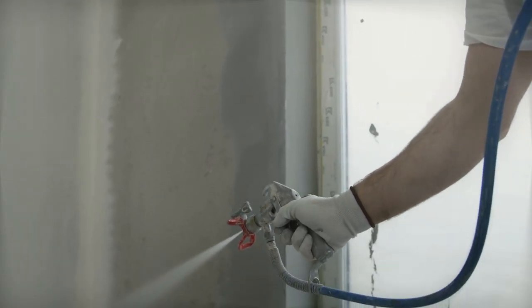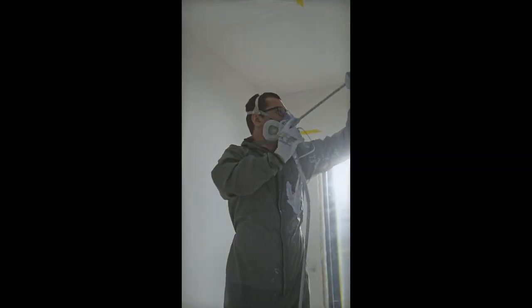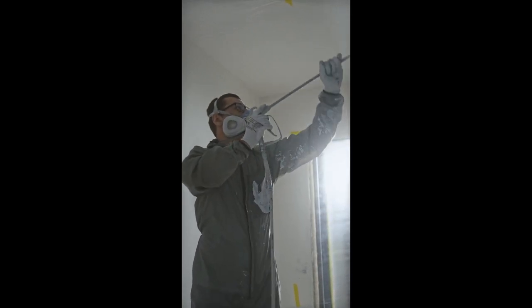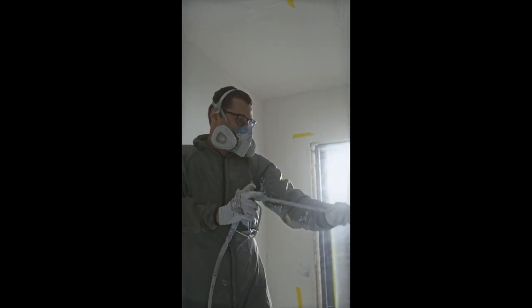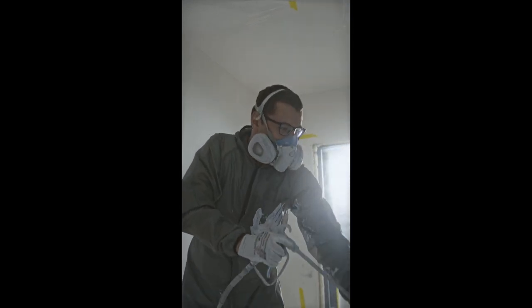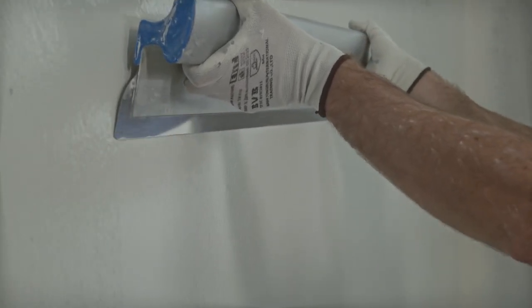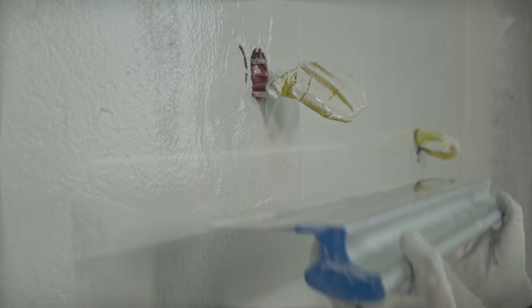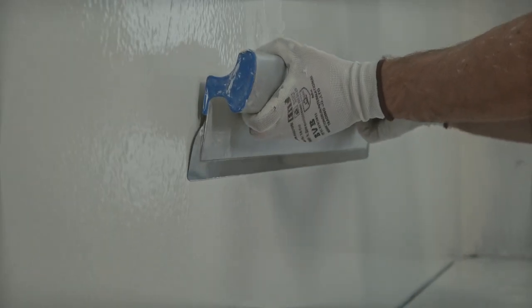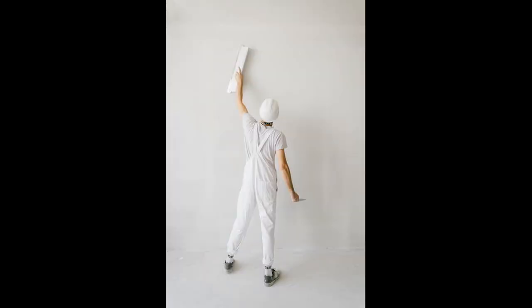Before you start, we recommend having many Darbys at different lengths at hand. Using a 3-foot Darby works very well with this material. Make sure there isn't a low buildup of material on the edge of your Darby — it may cause scratching in your work. Keep an eye on your reference point on the floor so you know where the high portions of the wall are. If you haven't used a Darby before, use a light touch and try not to dig the edge of the Darby into your final pass for that coat.